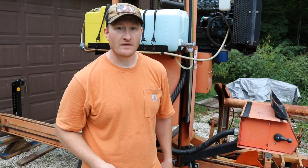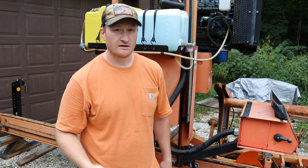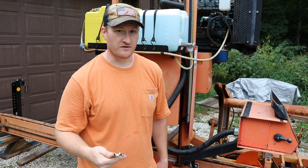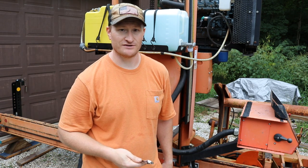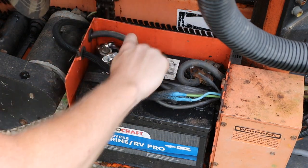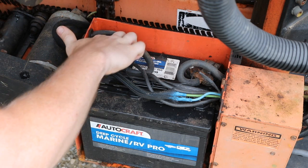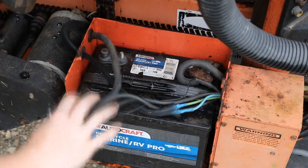The tools you're going to need are some basic wrenches, probably a screwdriver, a drill, and perhaps some sort of heat gun if you wish to do all the shrink wrapping. For the most part your basic mechanics tool set will get you through this job. First things first, we have to make sure the sawmill head is up and remove the negative battery terminal, since we're working with electronics and we don't want any shorts happening.